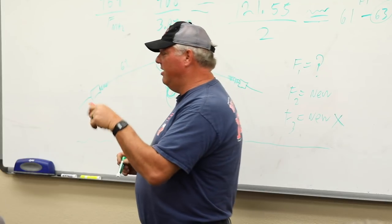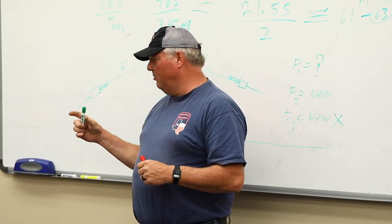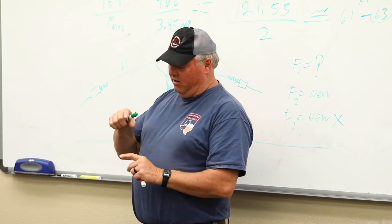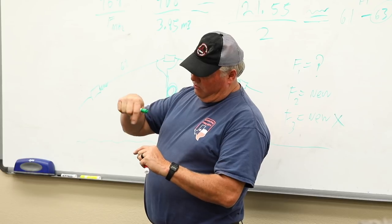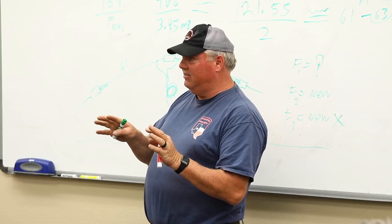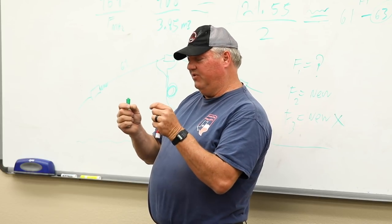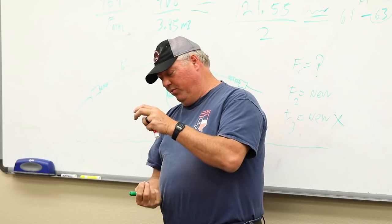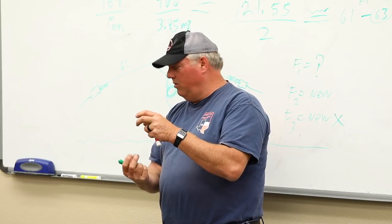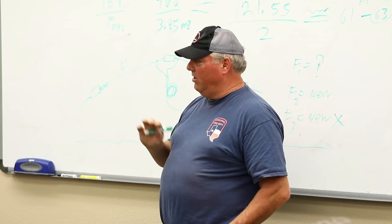It's interesting you bring that up, Skip, because when we talk about baluns, I'm going to bring in some commercially made baluns and some ones that we made. And we actually made them on PVC pipe. They're this tall. They're wound with dumb, inexpensive RG-58, intentionally not double shielded, and we use stainless steel hooks and connectors. Then we put an SO-239, the female connector, to make that. But I don't want to go into that tonight.